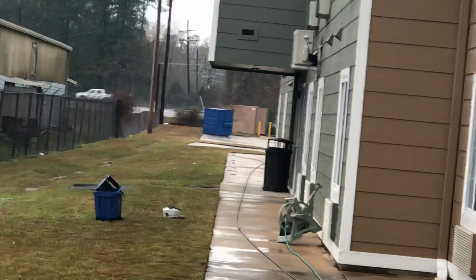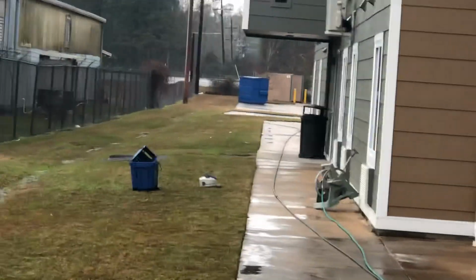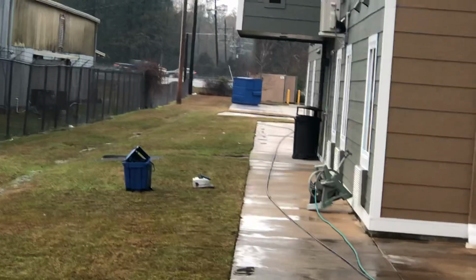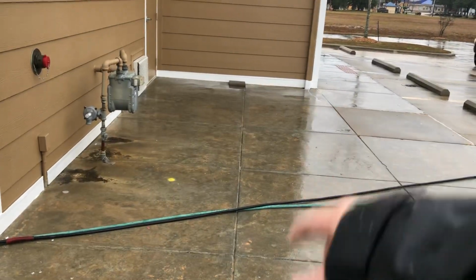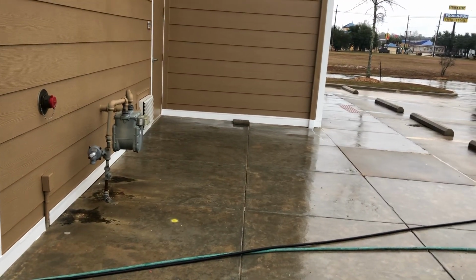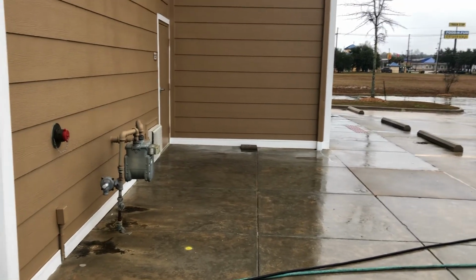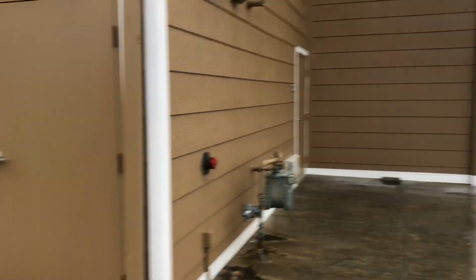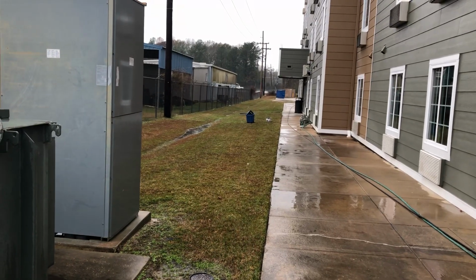Now, there are two reasons for what we're going to do there. The reason we have our slack way over on this side is that the hose wants to contract and expand. And if it's contracting and expanding on one of these corners, if it was around this 90, it would rub in that area. And it's a lot of movement. It could pull off a board. That rubber's kind of sticky. It gets in little cracks and stuff, and that expansion is going to be several feet in that area, so it can pull those corner boards off or rub some damage.